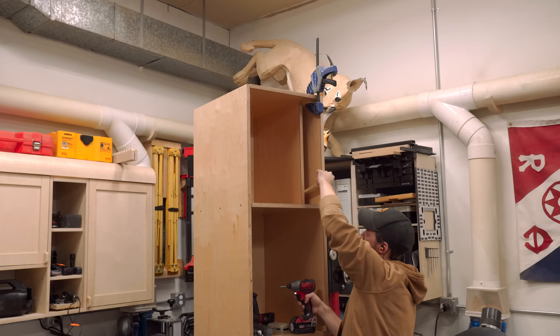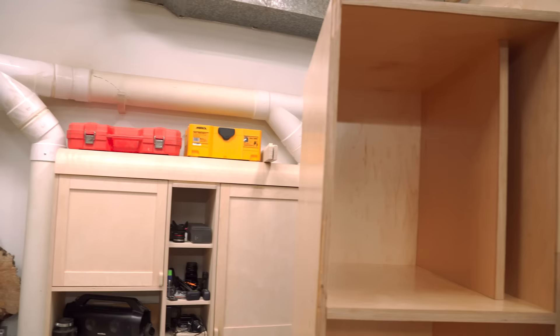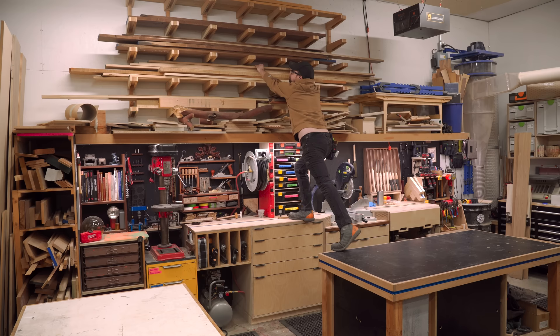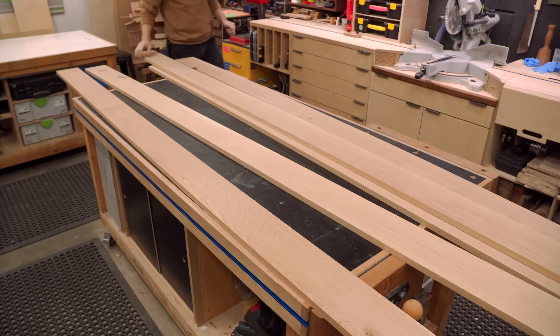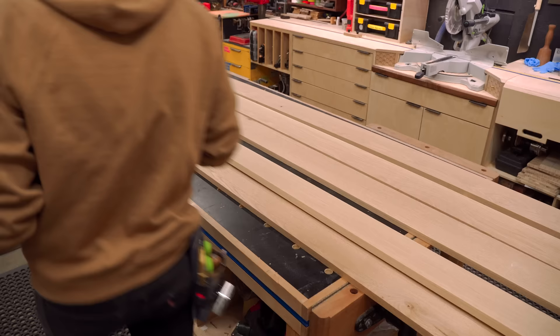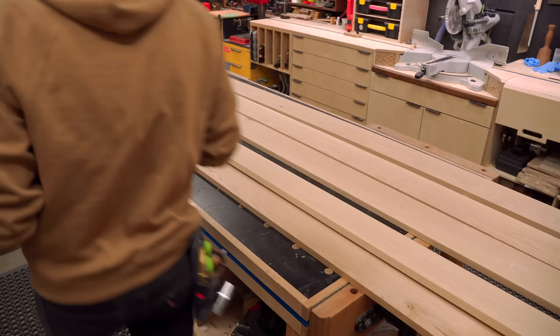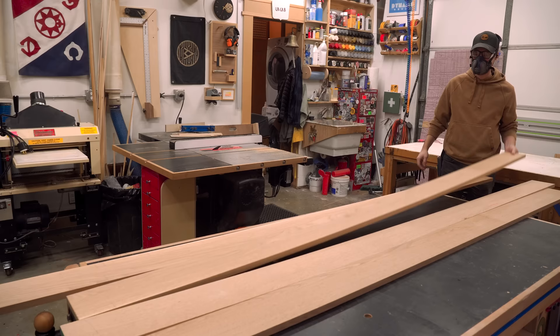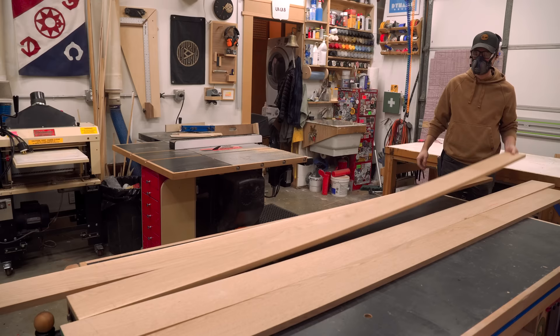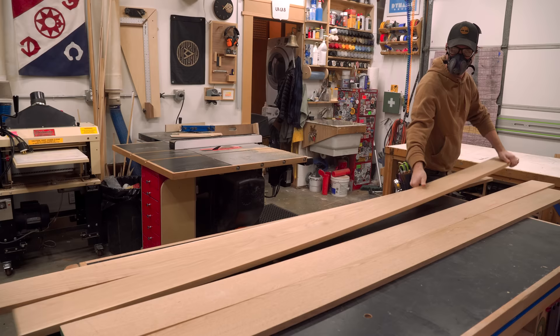I feel like this is the best solution I could come up with short of doing it in the initial glue-up phase, which would have been really challenging. While I'm still waiting for the pocket door hardware to arrive, I decided to start gluing up the door panels. For the chimney cabinet I really wanted the doors to be continuous grain from top to bottom, so I'm using solid white oak. I bought some 10-foot sticks from a local lumber yard - they're S4S which means they're sanded on four sides and pre-milled. I always like to trim the glued-up edge, and you'll notice I labeled them up and down. This is a technique to get a better joint: the first run on one side will be facing up on the table saw, and then I flip the opposing side over and cut that side - so if the table saw blade is even a tenth of a degree out of square, it will still marry up perfectly.